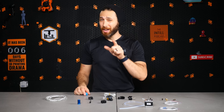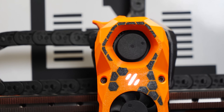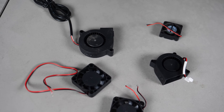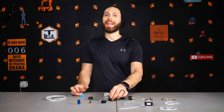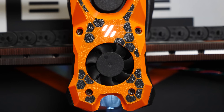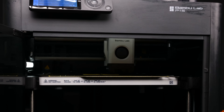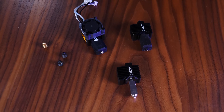Assorted fans. One thing that you can't make at home is fans. You can actually run your 3D printer for a short period of time without things like the part cooling fan or potentially even the power supply fan, though neither of those things are recommended. What you can't do is run it without a heatbreak fan. And that's a real problem considering that these fans are almost always very specific sizes that you're unlikely to find on the shelf at your local store, at least not in the appropriate voltage. For this reason, if I have a printer I cannot afford to be out of commission, I always try to take note of exactly which type and size of fan it uses and keep at least one on hand at all times. For the Voron Stealth Burner, for example, it's a common 50-15 fan. But for things like the Bambu Lab line of products, it's usually a much rarer type of fan, and it might even make sense to just pick up an entire spare hotend assembly.